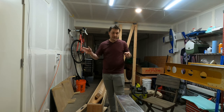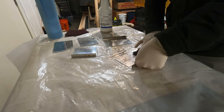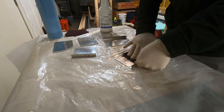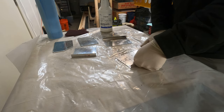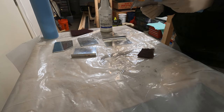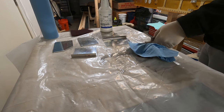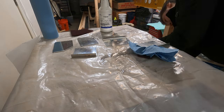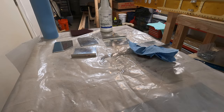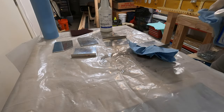And what I do is I take the Scotch-Brite, I scrub down really heavily one side over the other. I almost let the stuff pile up on the table and kind of create this slurry down there just to keep the parts wet. And then it gets wiped off with just a clean paper towel. And then with the clean hand, I hit it with the acetone. And so we'll cut the cleaner, the pre-coat, off with the acetone, doing a final clean.